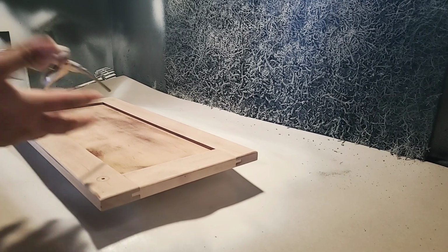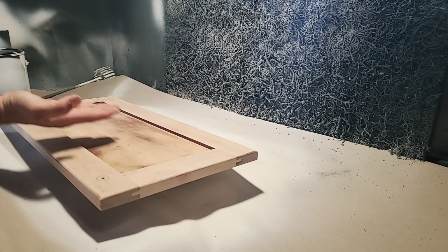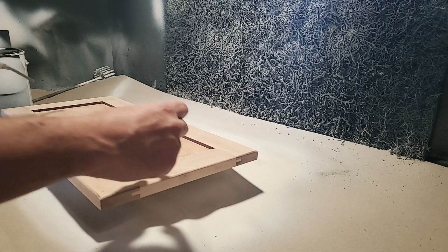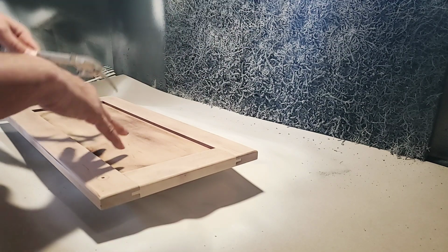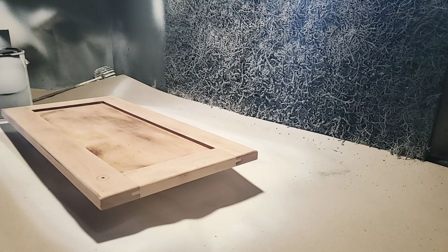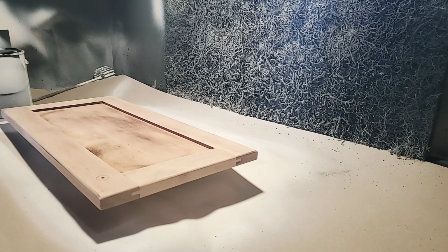Keep in mind, anytime you blow liquid or compressed air across a surface, including the spray paint, you will charge this surface and make it electrostatically pull any debris into the finish. So if you guys are having any sort of issues with that, make sure you ground your air as well. That helps mitigate that.